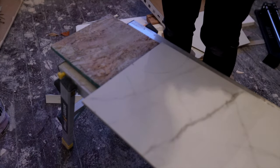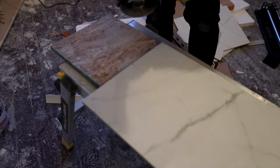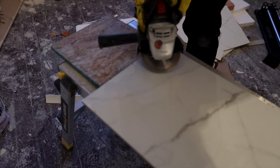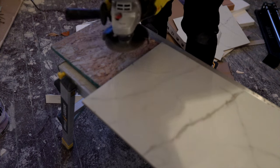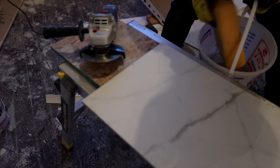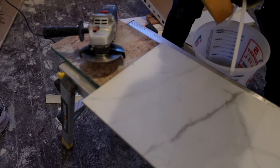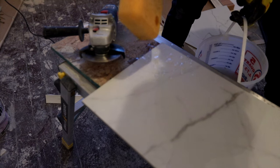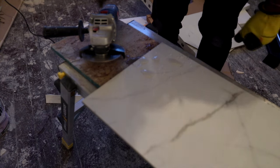Take your tile, diamond blade on a grinder, and here's my mark. What we're going to do is go in at a sharp angle — maybe 45-ish — digging in, starting our groove, and then rotating the grinder. That will give us the circular profile. I have a bucket of water with a sponge that I'll douse the tile in every few seconds, and a piece of wood underneath so I don't cut into my bench. It's pretty cold tonight so I'm doing this inside.